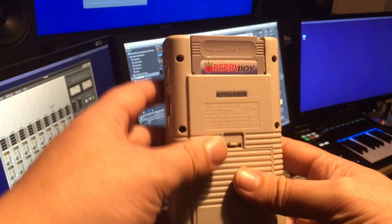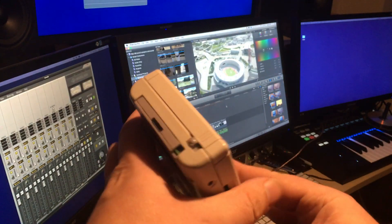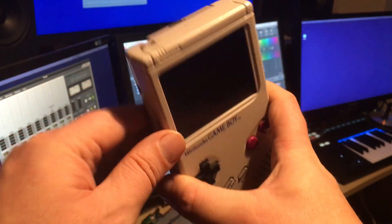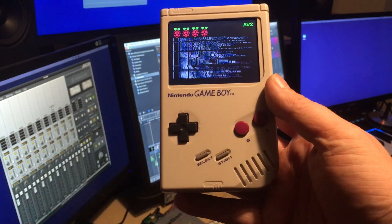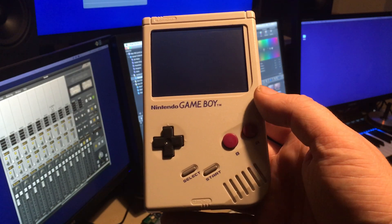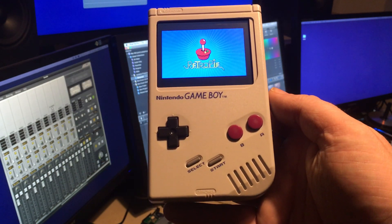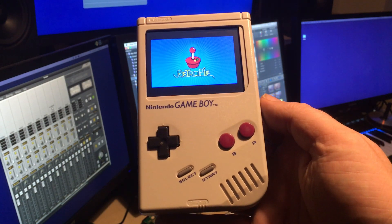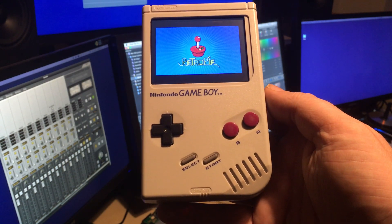The Raspberry Pi is directly behind that. I managed to keep the original switch, which is what I wanted, but I put it in the wrong way round. I assumed I'd be making a circuit to switch it on and breaking a circuit to switch it off, but the charging board doesn't work like that, and I didn't want to just disconnect the battery because then I wouldn't be able to charge it when switched off. So yeah, I'm just going to have to live with it going the wrong way round — only a couple of people have picked up on it so far.